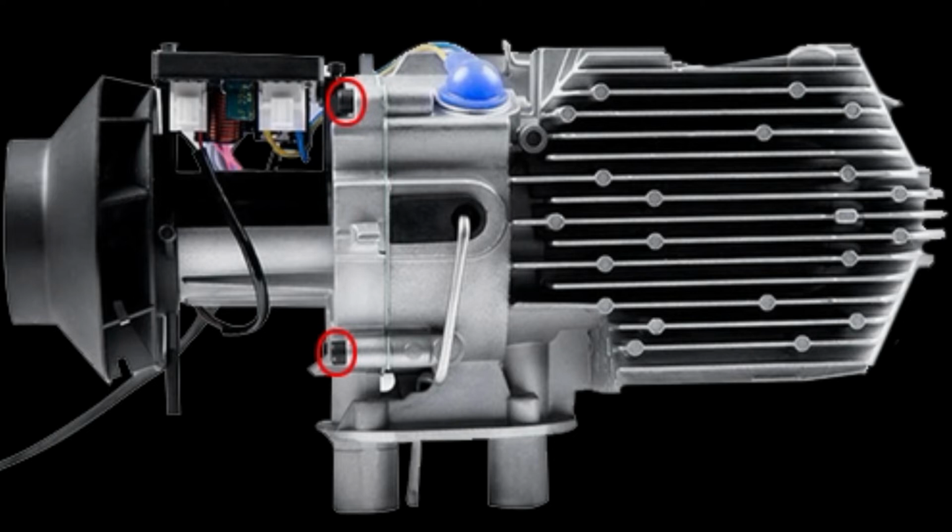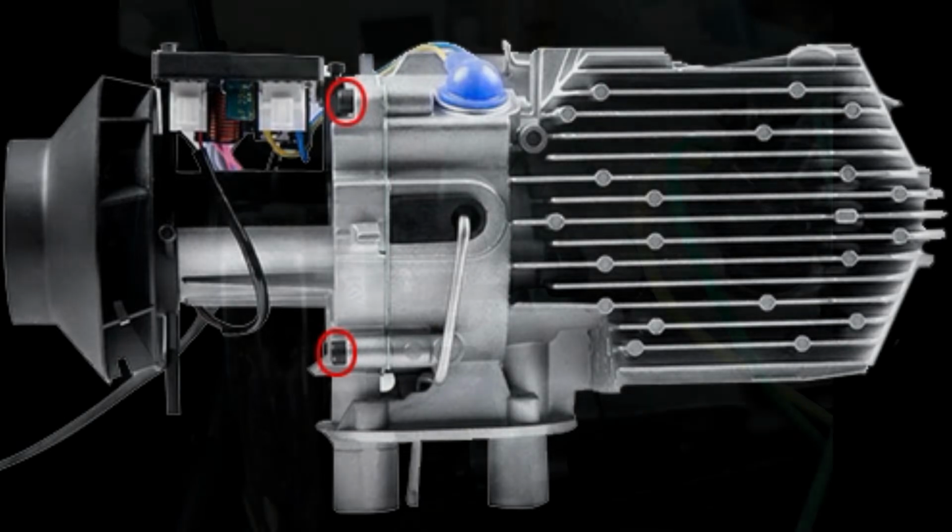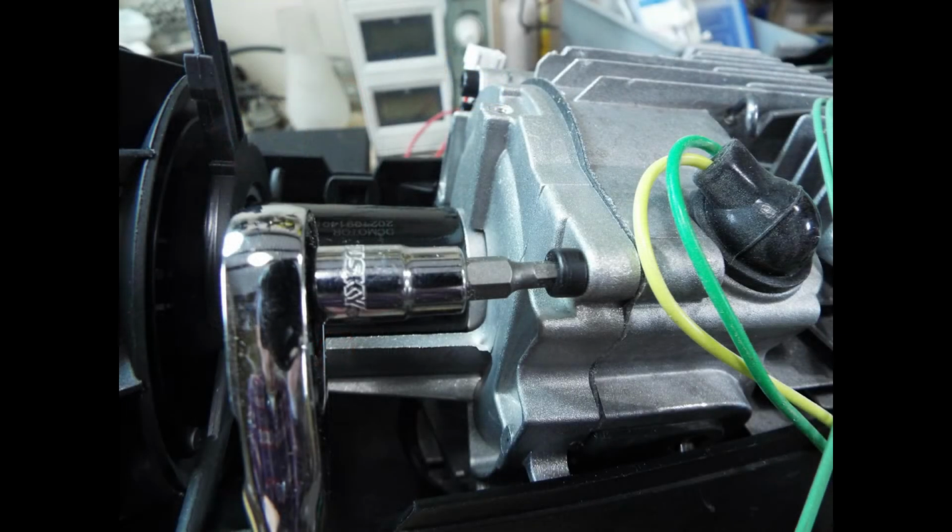So what I think is happening is because they're not tightening them down, the pressure builds up as the thing starts to burn, and it leaks exhaust out. Now, as soon as the body gets good and warm, it swells and seals the gasket, and then the smell goes away. So, as you can see in this next picture here, I just took a 4mm Allen and a ratchet and snugged the 4 down, but somewhere between 1/3 and 1/2 a turn.